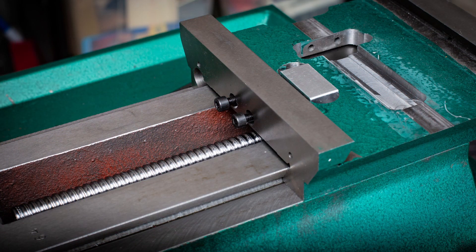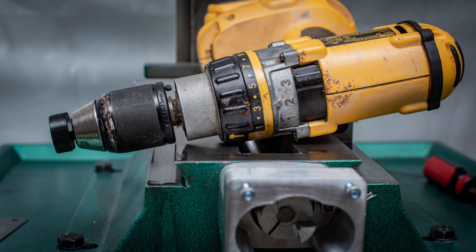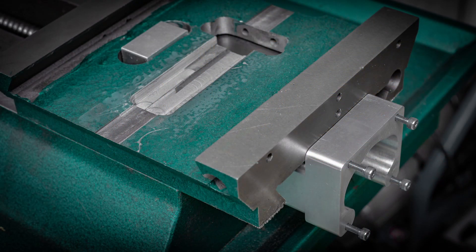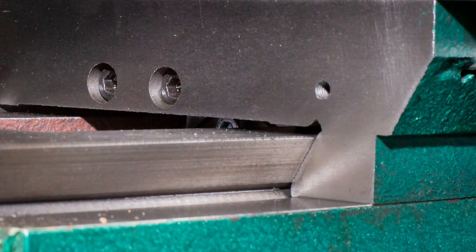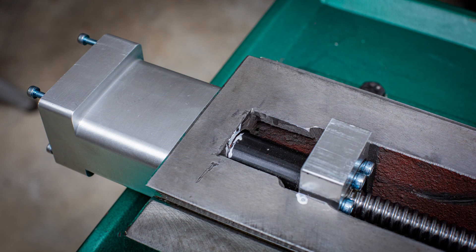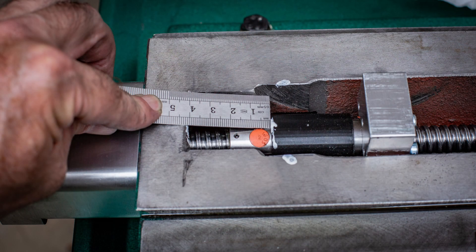With the y-axis gib installed it was time to do the final alignment on the y-axis lead screw. Leaving the cap screws loose that secure the clamping block, I used my drill and the shaft coupler adapter to run the saddle all the way to the front of the mill — maximum Y negative. With the motor mount tight on the front of the mill I turned the clamping block level and then tightened down the cap screws against the clamping block. I marked the maximum forward travel of the ball nut with a bit of white paint, then removed the saddle, positioned the clamping block at that forward location, and put a dab of white paint on the ball nut cylinder. Here we can see about 20 millimeters of the ball nut disappears into the front of the casting when it's at maximum travel.